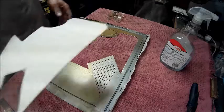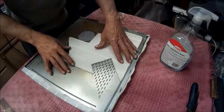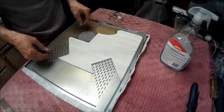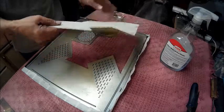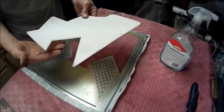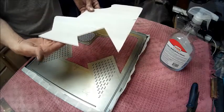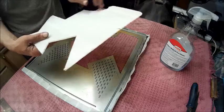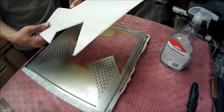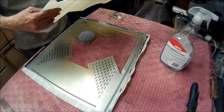So now we've got the piece cut out. I've laid it on here about where I want it. Alright, and I've taken a pencil and marked around it all the way around. And you want to put tape on both sides of your piece so that when you get a bandsaw, the shavings that come off of this don't get underneath it between this and the table and start scratching the plastic up. Which I've got to doctor this plastic up anyway because it was stuff that was just laying around that got abused and needs to be polished so it's shiny again.